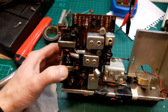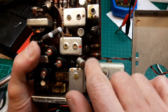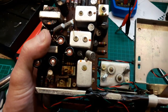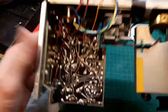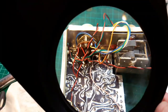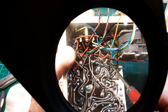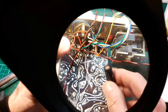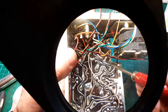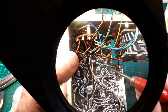Okay, let's show how it really is for me, how I do these things. So there's the AF117. Now it's got four legs that are like a square grouped together. There's the Hunt's capacitor we're after. So then you flip the board over and everything looks like it's in a mirror, so you don't know where anything is. But there's a few telltale signs. Let me get this in to see if it works. I'm hoping it's clear. So with my pointer now, you see these two holes here, they are that Elcomo capacitor just pulled out. Now I know going this way on the board, next to it is the AF117. And like we said before, they tend to be four grouped together, which I can see there.